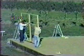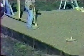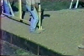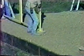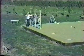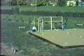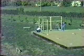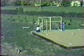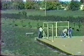Now with this knowledge of the hardware, we will start to erect the barn. First, we will set the panels and fronts on the pin clusters. No piece weighs over 150 pounds. Therefore, no special equipment is required to set the barn up. After the wood, roof, and other materials are added, the barn becomes very heavy. It is certified to make a 40 pound per square foot on the roof snow load and a 25-pound wind load, which is in the 90-mile-an-hour range.